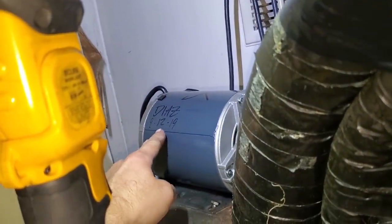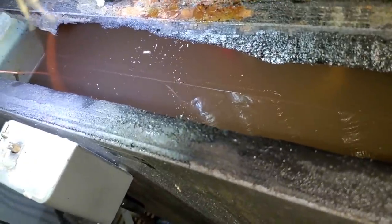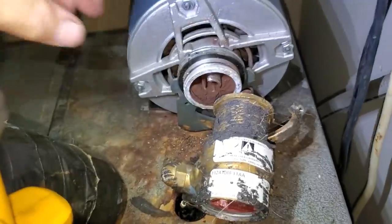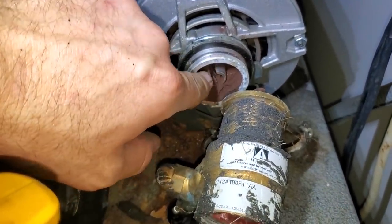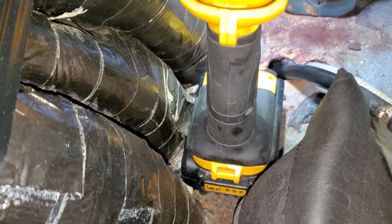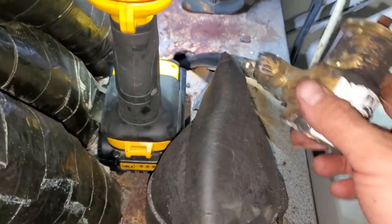It looks like another company changed it back in September. But looking at this glycol — since I stuck my hand in there, look at how cloudy it got. There's a bunch of silt on the bottom and just nasty crap. They need to get this glycol cleaned for sure. And if you pull the pump off the motor, it looks like it's completely spinning inside there — it doesn't even look like it'll grab anymore. The pump is also really hard to turn. That motor is spinning right inside that pump, and that's the problem. We need to get a new pump and motor.